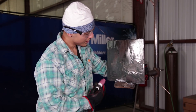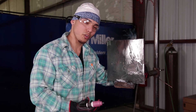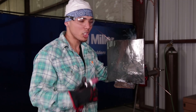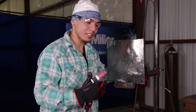I got a flat plate here. Main thing about TIG welding, like y'all saw in my Walk the Cup 101 first video, prep is very, very important. Make sure your plate is real clean — no mill scale or anything like that. Your puddle runs way better, everything's just more clear. Make sure there's no mill scale.